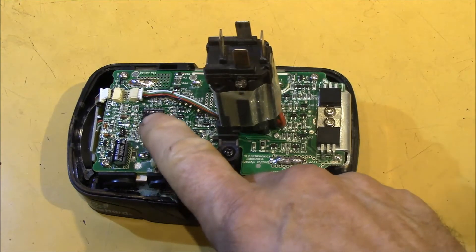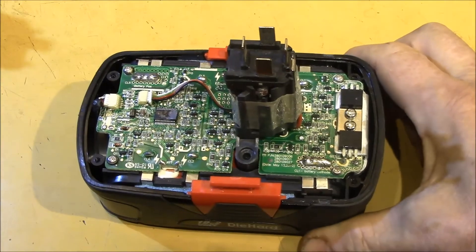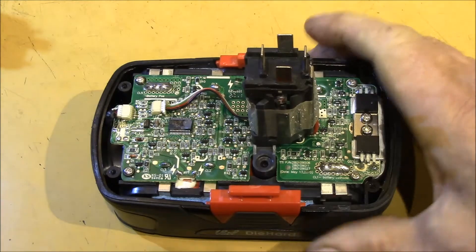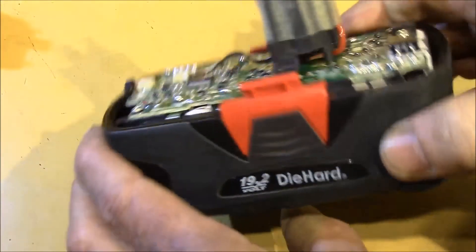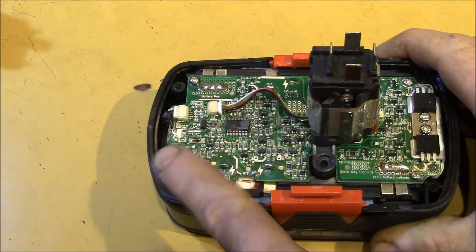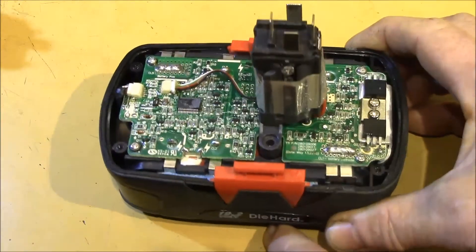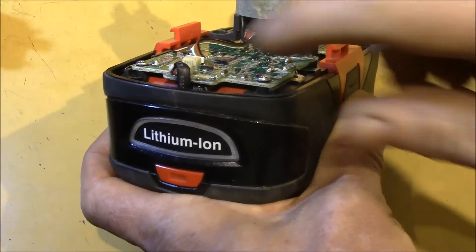On this one I can make out the 28-pin IC markings. Here's the Extended Capacity Pack or XCP — it has a May 2010 date code and is nearly identical to the last BMS. The only major change is that the capacitor is now underneath the PCB, probably for space reasons, since you have the 10 18650 cells jammed in below. They added a small bump-out on the PCB to accommodate the capacitor down below.